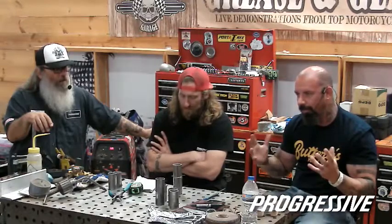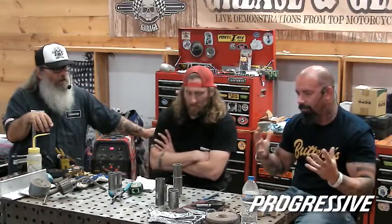Yeah, when it comes to that shrinking factor, that's huge. And every piece is connected to another piece. So that's where it becomes really complicated. Fixtures are important in understanding what the metal is going to do and how it's going to pull based on where you're applying the heat and the heat buildup in the process.